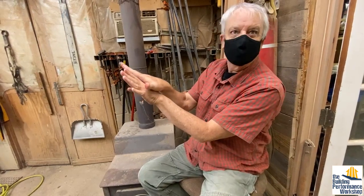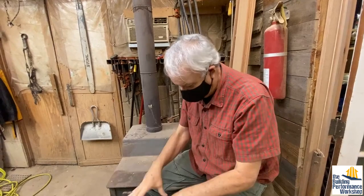Everything had to be hand-carved — he didn't want joints like you'd do on a split rail. For a curved rail, he wanted it all hand-carved all the way up along the bottom on either side, fluid all the way around. It was a challenge. We also did the elevator floor — you could buy a nice vehicle for what it cost to do that elevator floor. It had inlaid roses in each corner with pink ivory and green poplar, and each vein in the poplar was turned so that you get that right look — they look like they're just coming right out of the floor. We even did the heat and air registers because the architect wanted them to match the base, so some were poured with polyurethane but some had to be made out of wood.